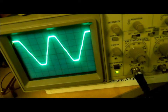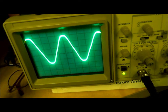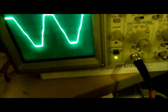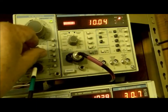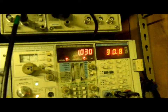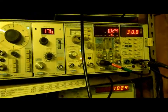There it is — clipping. Nice and symmetrical, top and bottom. Not much notch distortion. Clipping top and bottom is symmetrical — that's good. We run it up to about 10% THD. There it is: 30.7 volts. 30.7 is quite a bit of power — that's just driving the power amp section alone.